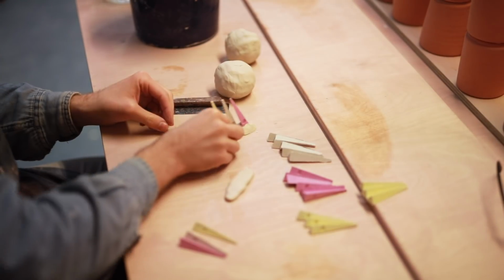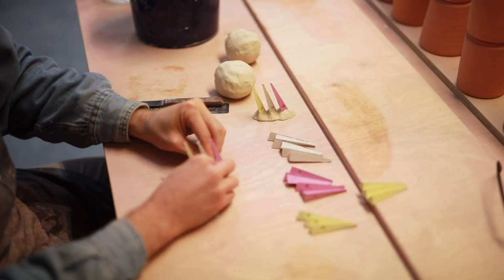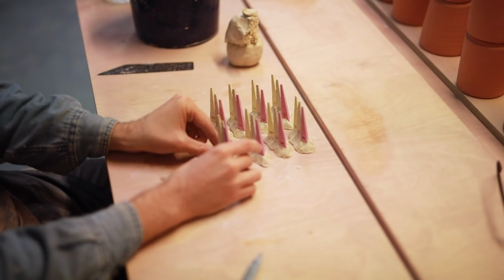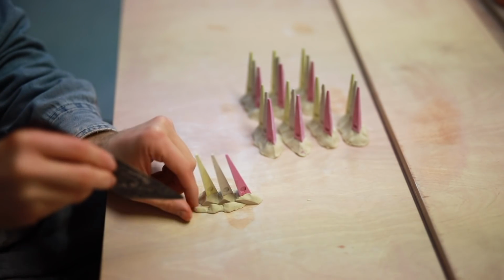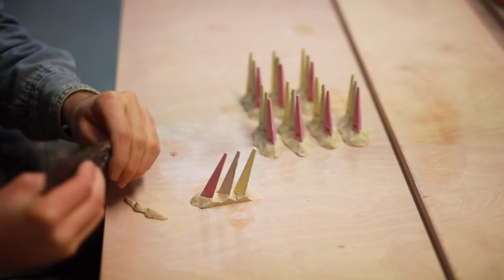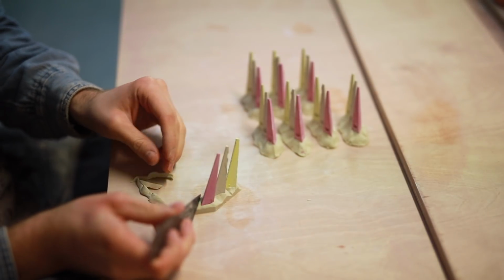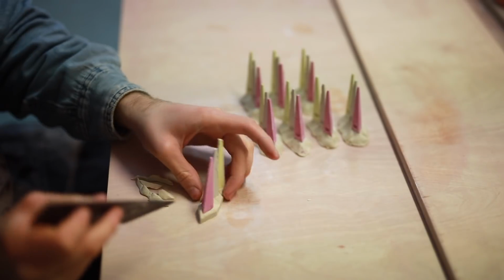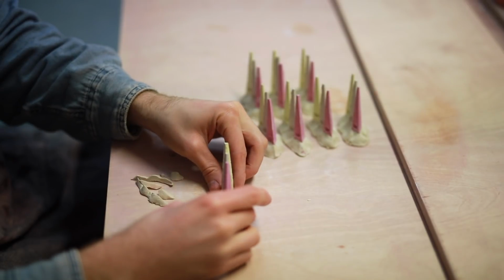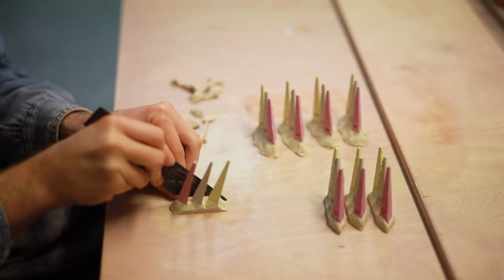They measure heat work, which is heat over time, and each one bends over at a very specific temperature, and it's by these that I know when to turn the kiln off. So in this instance, I'm using cone 8, cone 9, and cone 10. As they melt, they bend over in the direction they're facing, and this happens between 1247 degrees centigrade to about 1295 degrees centigrade. So they're measuring tools which I can use once per firing. I place 2 cone packs in each firing, but I always make a whole lot together like this, and then I can keep them stored away ready to use next time I fire. You'll see them in various states throughout this video, inside the kiln, and what they look like afterwards too.